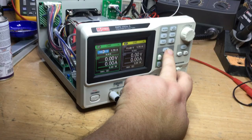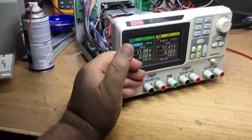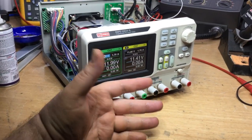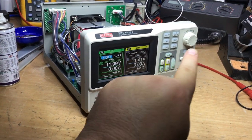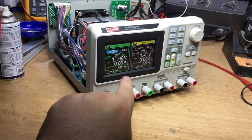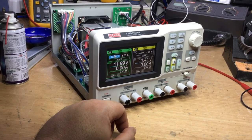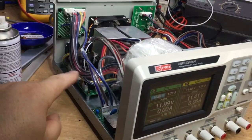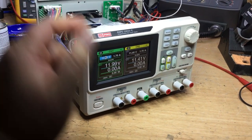So as the temperature warms up, see, that's on now. Energising those relays on the front panel to switch these outputs on is now drawing more current from the bridge rectifier, because as we saw earlier, the trace came off the regulators after the bridge rectifier and went all the way down to the relays across the back of the board, and thus it supplies all the relays across the entire unit. There was also a plug which fed a wire off to the back board down there, and there's relays on that as well, as we know, for switching the fan and other outputs and taps on the transformer.